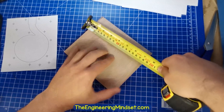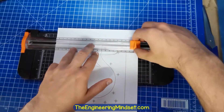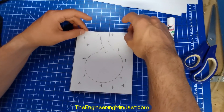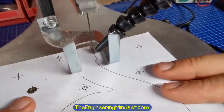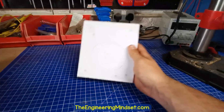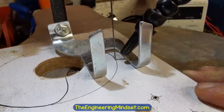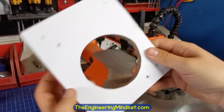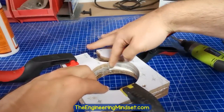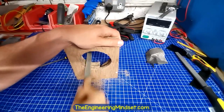To build the pump, I took some sheets of wood measuring 145mm wide, 170mm high, and 12mm thick. I printed out my volute drawing, trimmed the paper to size, and glued it to the wood as a template. To save time, I screwed two sheets of wood together and used a scroll saw to carefully cut the centre out from the template. I then glued the template for the back plate to another sheet of wood and used a hole saw to remove the internal segment before cutting out the centre. With the main parts made, I used strong wood glue to form a seal between each sheet, then screwed all three sheets together and used a file and sandpaper to ensure a smooth internal surface.